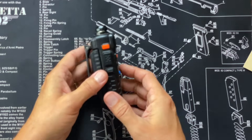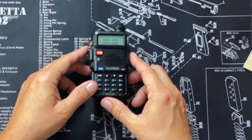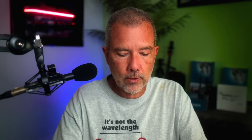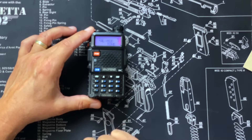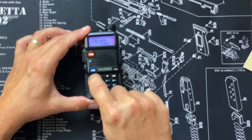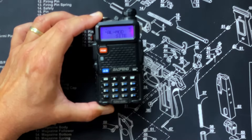The next option is the alarm option. The UV-5R, being the best engineered radio in the world according to ham radio operators worldwide, has an alarm call button. If you press and hold the call button it makes a wonderful alarm noise. By default it will transmit that alarm noise over the air, so most people set it so that if you press and hold that button accidentally, it only sounds through the speaker and never transmits. That's menu option 32. Go into menu, type 3-2, alarm mode — right now it's set to tone — and change it to site, so you only hear it on the radio through the speaker.